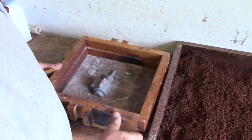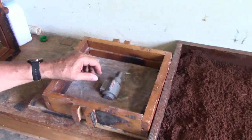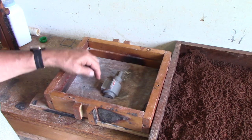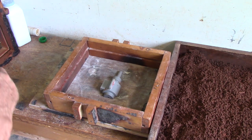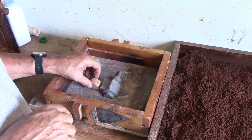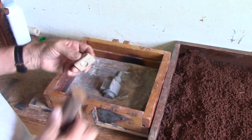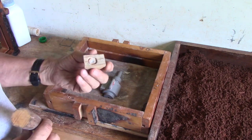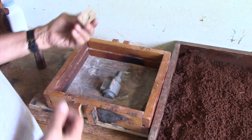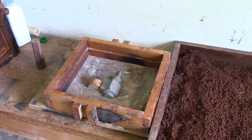I'll bring my riddled sand right up next to the flask box. I have to think about how to fill this mold with the molten metal. One of the best things I've found is to have a little pond, a reservoir that's rounded so the metal can flow — have that reservoir about the same depth as the pattern. I'll put my filling sprue right there. You can just carve this out of the sand once you pack it in, but I like to have it preset.